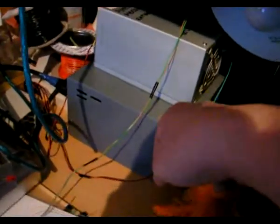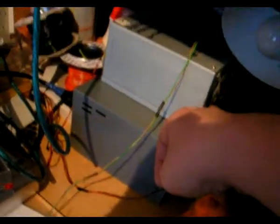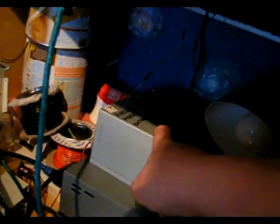Yes, it is handmade — that's why there's bits like that, a bit of rough edge there, which I've filed lots of times. All speakers. It is an old computer. These two boxes here, that's the power supply on the bottom. That is homemade — it's just a transformer, bridge rectifier and voltage regulator. On top is a control module.